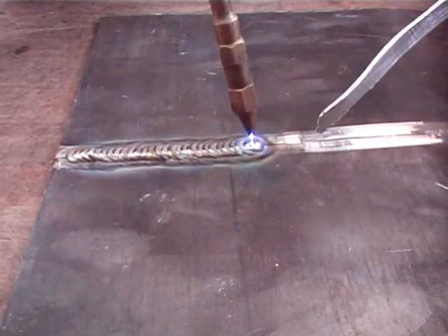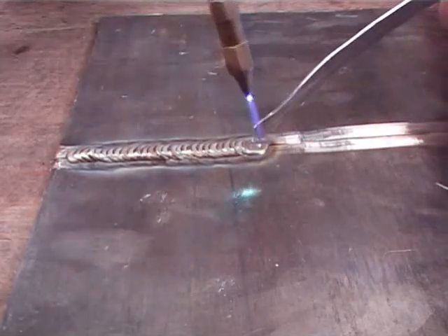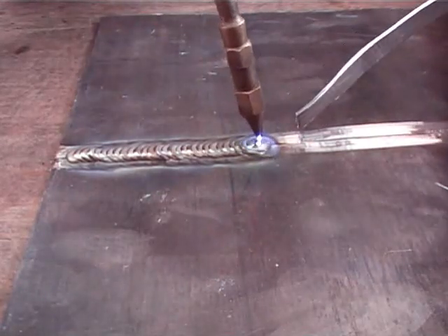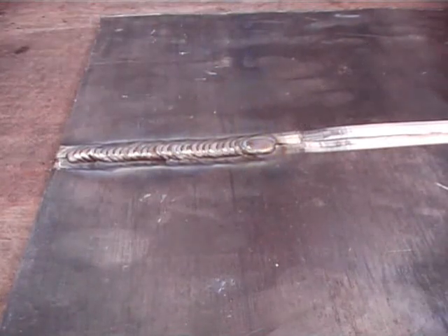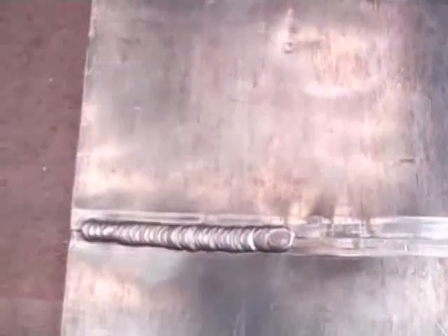Another thing to watch out for when you're welding is that molten metal should look like a mirror — you should be able to see the reflection of the blue tip. When you're finished, the best thing to clean the weld with is hemp, because it's got a little bit of linseed oil in it. The linseed oil won't hurt it if you have to go back and weld over it again. You can see how nice and clean it comes with just a couple of rubs — and that's a butt weld.